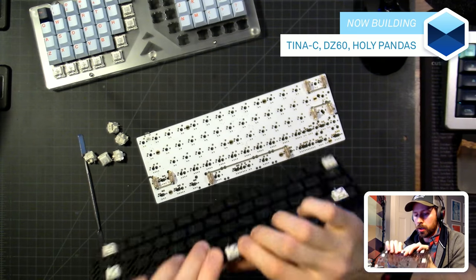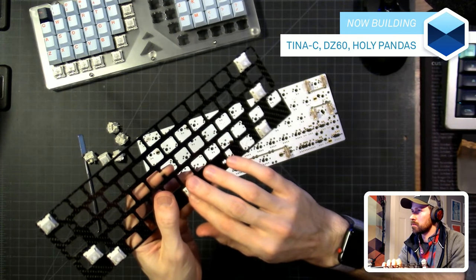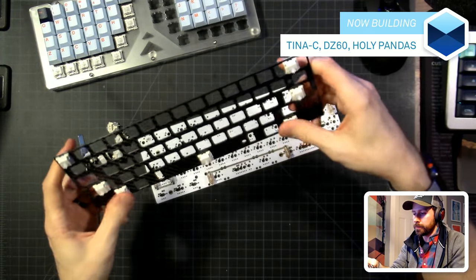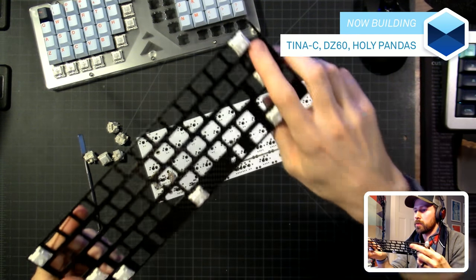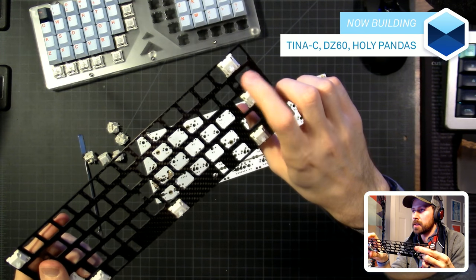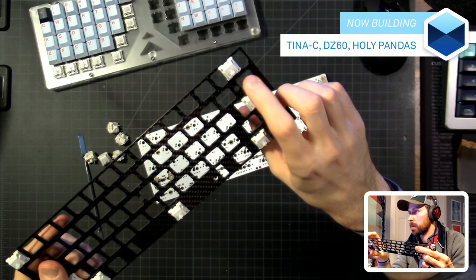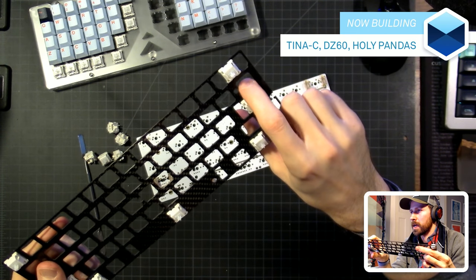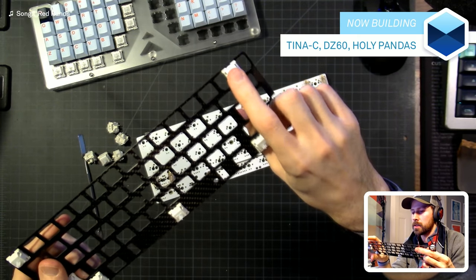Ouch. Okay. Yeah, that may make for a bad space key interaction, but we'll see. And I'm not doing the standard HHKB style, which would be two keys here, because HHKB puts its backspace where the backslash normally is on the US ANSI layout. But I use too many other keyboards to get used to using this as a backspace, so I've stuck with a standard backspace. So I'll do a standard width backspace or delete key here.